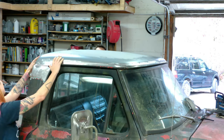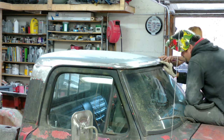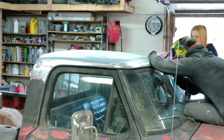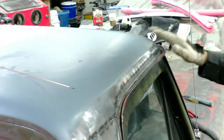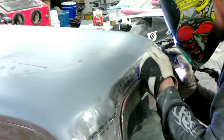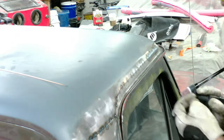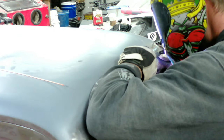Here we are installing the new — well, used — roof skin. We had set it there, tacking in place with the TIG, doing about an inch to an inch and a half every tack. We're kind of pushing it in, taking two screwdrivers with flat tips and pulling out and pulling in, making sure that butt weld is as close as possible. I was lucky on this one that the two roof halves wanted to peak a little bit, and that was easier because a weld like this could be a soft weld so you could tack it back down. The tacks are all done and we're just welding this thing in place, making runs. I'm getting this TIG as close as I can to the roof panel, and you can see the heat affected zone is not wide at all — it's not even making it into the roof, not warping the panel. This is a real strong area. This was the best way after all.